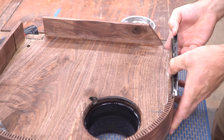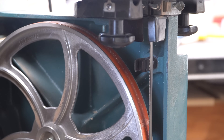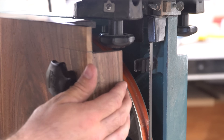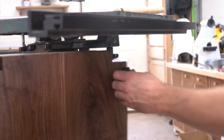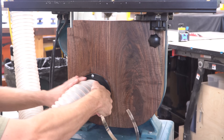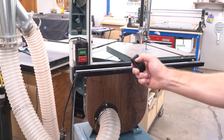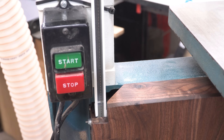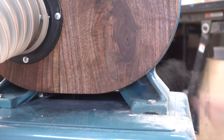I reinstalled the hinge and the door latch hardware, then mounted the door to the saw. That's when I discovered my hubris — that little notch wasn't clearance for the blade guides, it was for the trunnion knob. So after re-removing the piece that I had previously removed and reattached, the door was finished. I attached the dust collection hose to the port and secured it with a hose clamp, then hit the remote start on my Oneida system to do some function testing. I started by throwing some ultrafine dust from my palm sander at the openings to see what the airflow looked like. From the top, there was enough suction to pull this falling dust off course and into the cabinet body. And from below, there was enough focused airflow at the points where the dust used to pile up that it could pull dust up and into the cabinet.